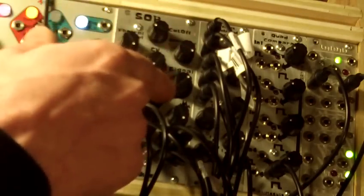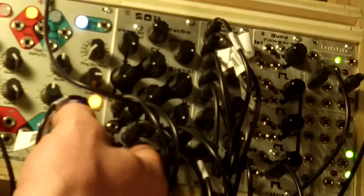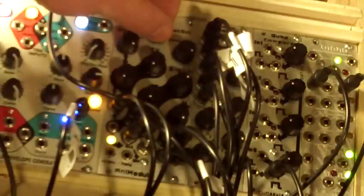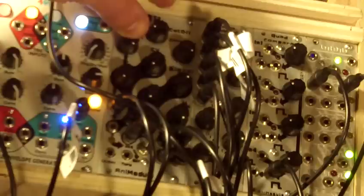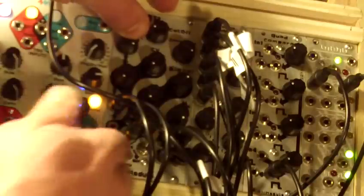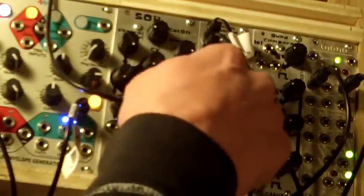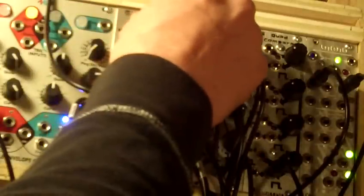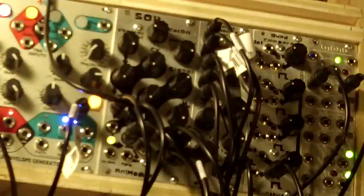Before the wave folder, before the filter, there's a VCA stage. If you turn the switch, now the VACTROL controls the cutoff and the VCA. If you have the switch flipped up, it's handy if you're running a sequencer, or to modulate the wave folder. As you can hear, it has a little more harmonics from the envelope, from the VACTROL input.